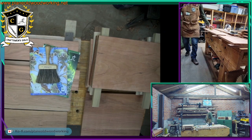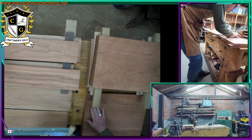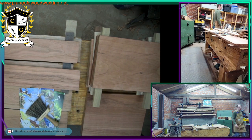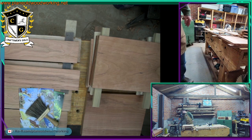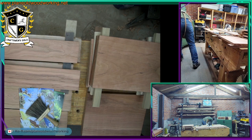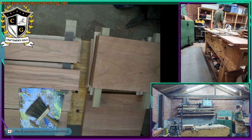Look at all this pretty wood that I apparently didn't fully... Oh, nope. Yeah, I did stack. Basically, all the wood has been planed down to 3/4, except for two boards, which are taunting me right now, because the reason they didn't get planed down is they're 13 inches wide, and my DeWalt takes a maximum width of 13 inches. You never put the actual maximum into a planer. So I gotta sit down and at least rip an inch off of each of them. Get down to 12 like the rest of the boards, because I feel like an idiot.